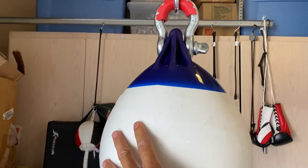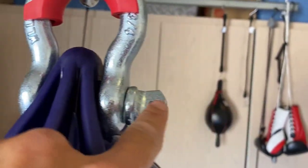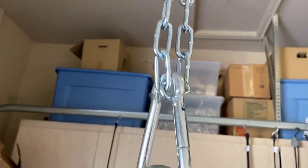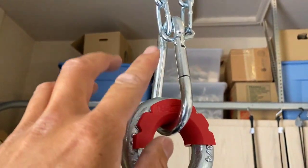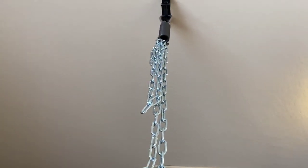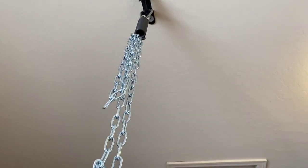Here's the completed setup of this A1 Polyform buoy. I just filled this up with water — there's the fill cap, screwed in with the flat tip screwdriver. Next is the metal turnbuckle that screws through; this piece is threaded and screws right through. Mine came with a little rubber sleeve that I left on so it's not metal against metal. I have a metal carabiner, and from there a metal chain that goes up to the top — I'm going to clean that up later and break some links off so I don't have so much metal dangling. A lot of times people do their own setup from there on up: you can use a rope, a different kind of chain, whatever setup you want.